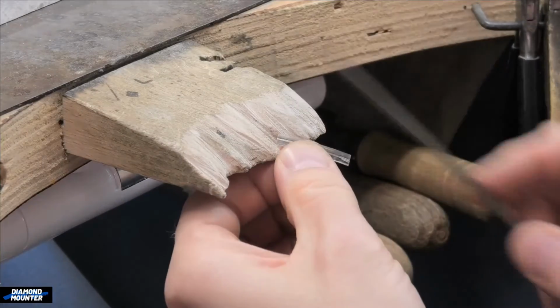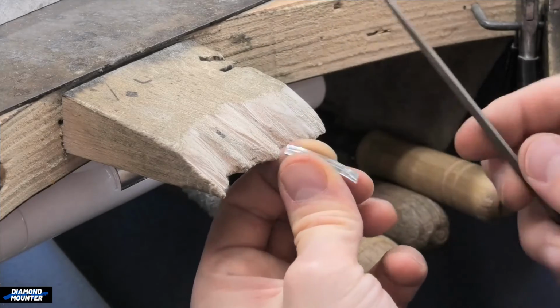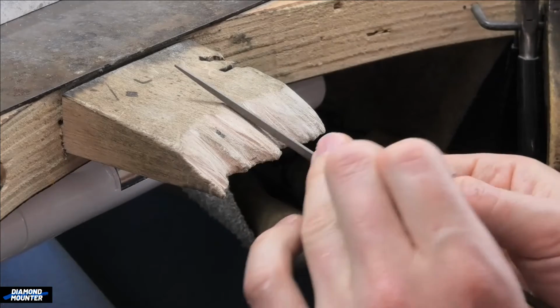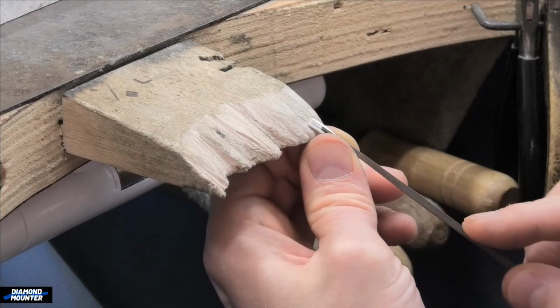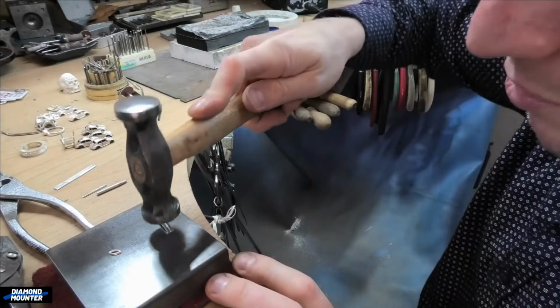Okay, that took a few minutes, just going up and down it with a saw blade. Probably not even halfway, just a little bit less. Leaving it curved still helps you out when you're doing the needle filing bit. So a square one, preferably nice and sharp. Just hook it in there, file away. Right, so get it flat, because we're going to turn it up now.